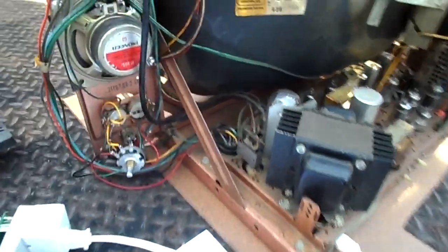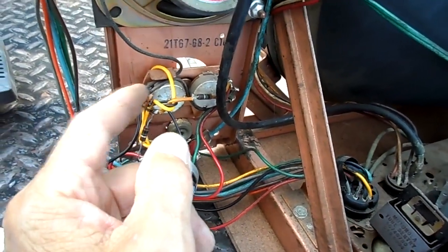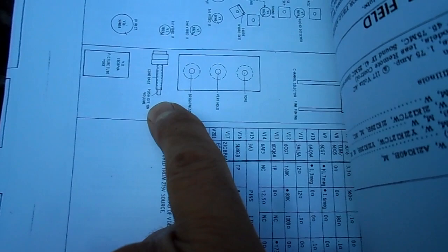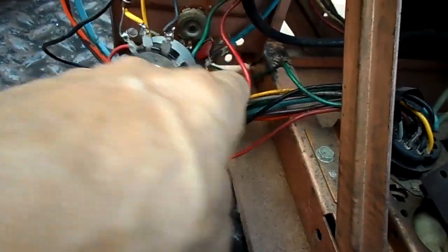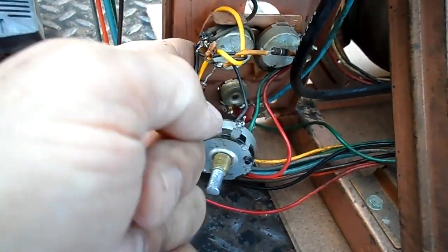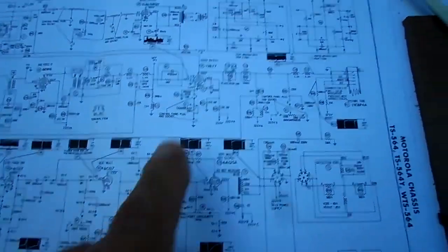I'll try to explain where I've gotten this far. The vertical hold pot — I determined that's the vertical hold. It has to be the vertical hold. There's a two-meg pot here on the Sam's. It just shows tone, tone, vertical hold, brightness, push on/off, volume, and contrast. So I can see with the capacitor there, that's most likely the tone at the bottom, so it's not tone. It's either vertical hold or brightness. I measured this pot here — it comes in at about 500K — and this one, even though the phenolic is broken, I was able to read about two meg, which corresponds with two meg on the vertical hold. And the one meg resistor here also corresponds with the pinout. The black wire was broken. I proved through magnification — without the schematic — that that's where the black wire came from. I verified that because the black wire is ground and goes to pin 11. Pin one is yellow. Pin one yellow goes to the center of the vertical hold pot.